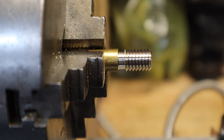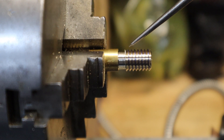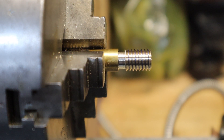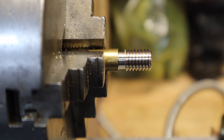Right, you're in a little bit closer now so you should be able to see just a little bit of blue left on the tops of the threads. This thread at one and a half millimetres has a little flat on it, and down in the thread at the minimum diameter there will also be a flat from the flat on the cutter. It's important when you start this operation that you've got the correct flat on the cutter, otherwise your measurement is going to be completely wrong. If you've got a completely sharp cutter your thread will be shallower than you want; if the flat is too wide your thread will be deeper and your wires will sit in more and measure completely wrong. So it's very important that your cutter is exactly the right size and your measurements are correct.